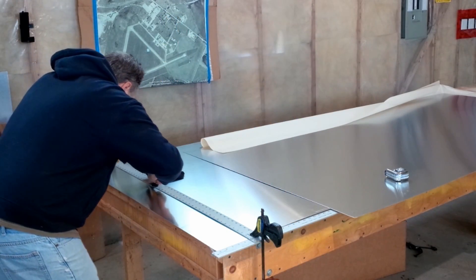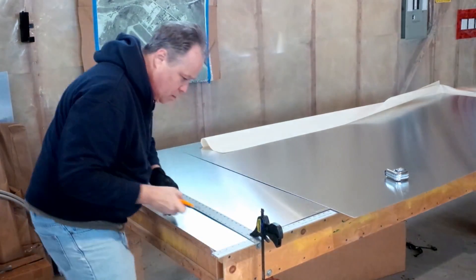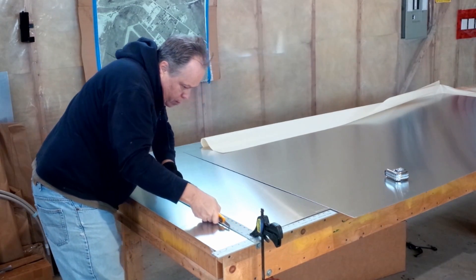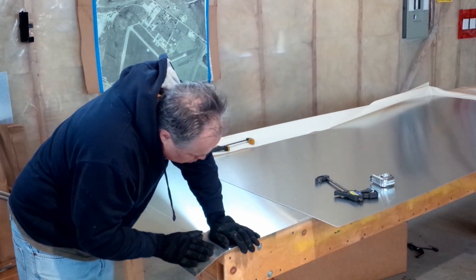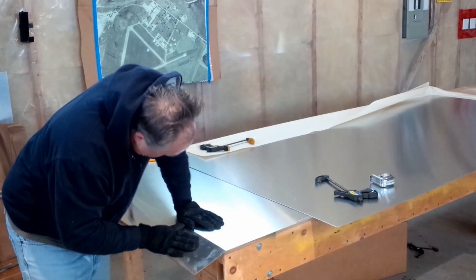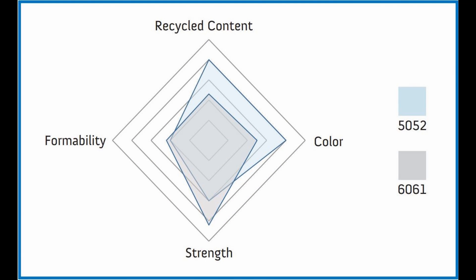I have chosen to manufacture my solar air heater boxes from aluminum. I chose 5052 — I have no experience with 5052, but a great deal of experience with 6061 T6. Around here, 5052 is one third of the cost of 6061, so I looked into whether or not it would be a suitable building material. The metals are similar: 5052 makes more use of recycled content, and 6061 is measurably stronger. 5052 alloy is the preferred choice in the market for consumer electronic casings, ideal for larger electronics like notebook computers and televisions.